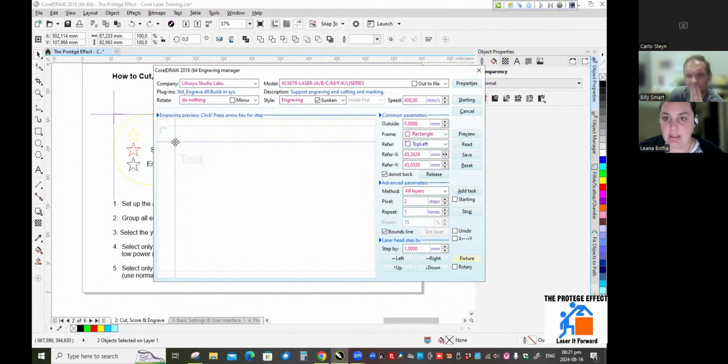So okay, let's just put it back to top left, and you can also drag these around, and by dragging this your laser will go to this specific point to use as your origin. So if I want the object to be kind of in the middle of my laser bed, I just drag this to wherever. But dragging it gives you funny values there. You can see the X reference will be 246,2107. So if I'm busy engraving funny shaped objects, instead of dragging this around and getting all of these funny values, I'll put in, let's say, 250 there and 100 there. Okay, let's do 200 there. Then it's kind of in the middle, but then I know if there's a power failure or if anything goes wrong, I can easily go back, put in those exact reference numbers, and I will be able to start at the exact spot where I was.